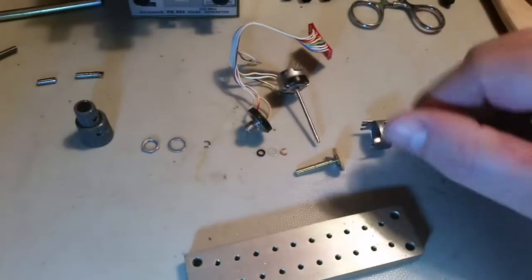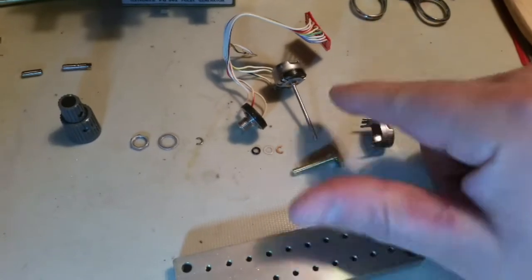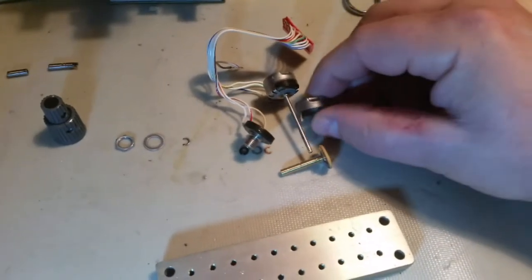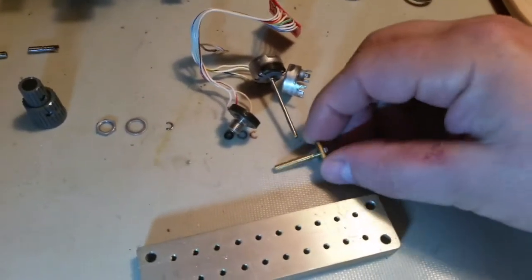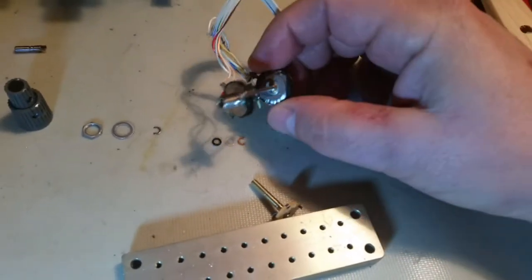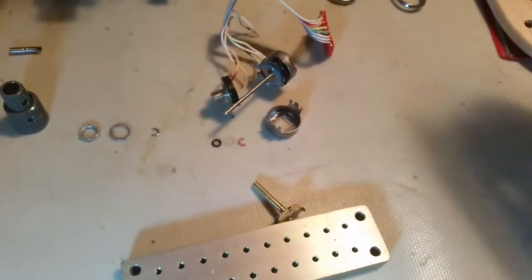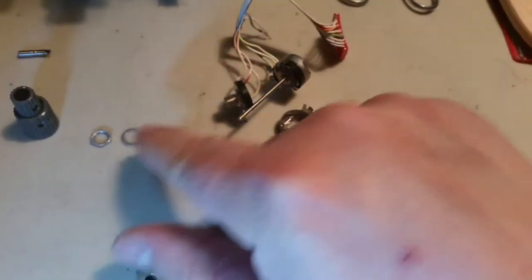For you average guys, you might just have to go out and buy one of these. And if you can't find one, you know how to take them apart. As long as this piece is good, you could probably take the center piece out of another double-ganged potentiometer and just change this piece out right here, because the wiper and the disc and the shaft should be the same. The only difference would be this and the other wiper. How this is mounted — it looks like they just used some JB Weld to hold it together, and that's probably what I'm going to do. The knob and everything will hold it on.